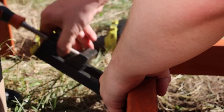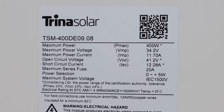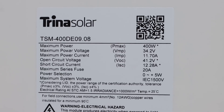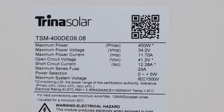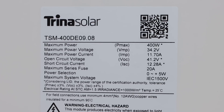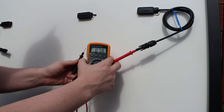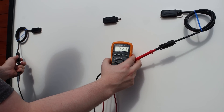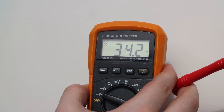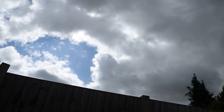I'm actually putting two of these panels on a single frame. One of the interesting things you can test is the open circuit voltage or the maximum power voltage — you just plug a multimeter into the two MC4 connectors and read the voltage. In this case I'm reading almost exactly what it reckons is the maximum power voltage, which is perfect. It's a great way to ensure the panel is still working before you mount it, especially if you're going to put it on your roof.